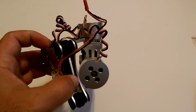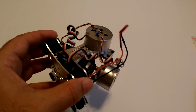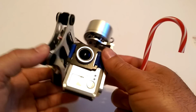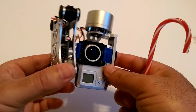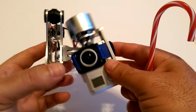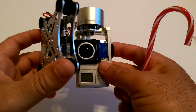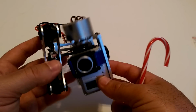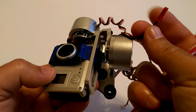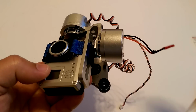It's just your basic gimbal. It's got two plugs that come in the back, one for each motor, for your pitch and roll motors. And it works really well for how cheap it is, $50. If you're just getting into quadcopters, maybe larger GPS enabled quads, or hexcopters, whatever it may be, and you want to get something cheap, this is actually a really good option. Works good. And the other thing I had to do was put on this JST connector. It comes with the male side plug, and I had to switch this out for it to plug into the bottom of the Cheerson quad.